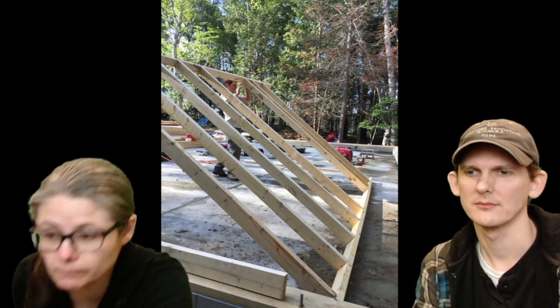But in this case, it wasn't an issue. We took a 2x4 and laid it out, end nailed it over here with a couple of nails, and then you do the other side. It's all just measuring, making sure everything's 16 inches on center. You need markers or pencils to mark them, a tape measure, and someone to hold the other end as you're nailing them in. Otherwise it makes it really hard. You can do this by yourself, but it sucks. Two people is much easier.